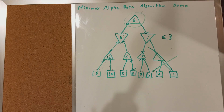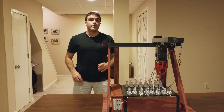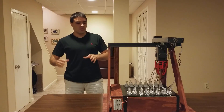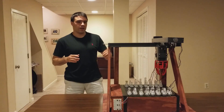Chess trees have over 20 possible moves per level, which exponentiates the number of calculations dramatically. A search tree that searches 5 moves deep would have roughly 3.2 million moves — the deeper the software can search, the better it will be at playing chess. The Arduino code does two things: it reads human input data, which it sends to Python, and it receives computer move data from Python, which it executes via the robotic arm.